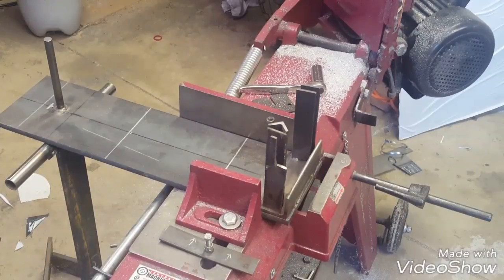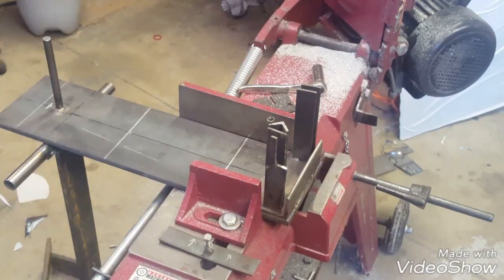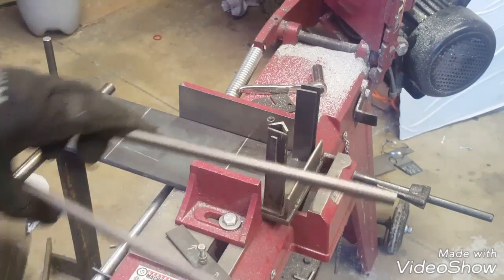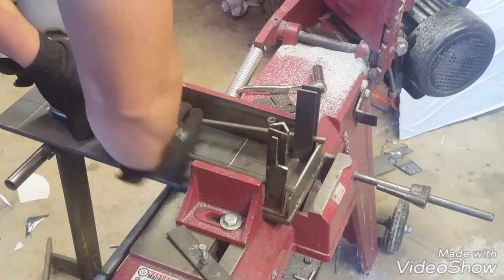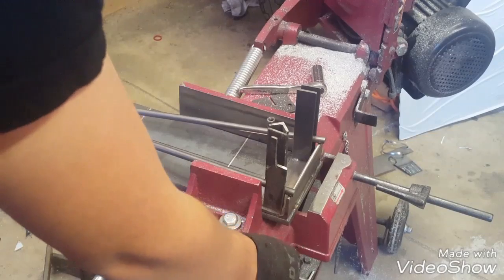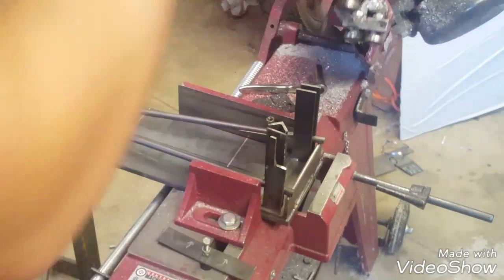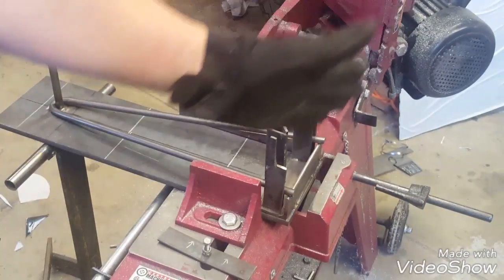Now this is my cutting fixture. It has slots right here to keep them in line straight up and down. This is the backstop piece, and it has this piece so that all my cuts are angled at the same angle. All I do is — this will be a long piece — stack them up to nine, make sure they're pushed in. This clamp goes up here and clamps it down, then all I do is lower this down and that makes a nice straight cut all the way down. You've got to make sure your saw's cutting spot on, otherwise it's going to want to walk in or walk out.